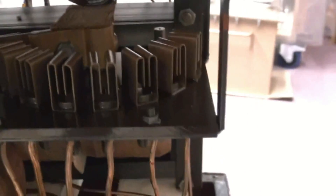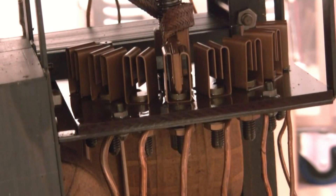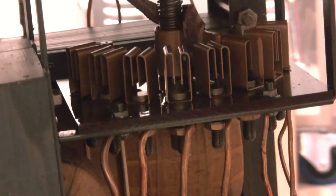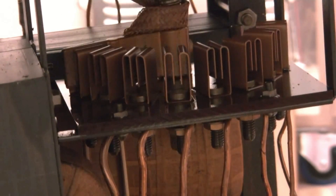This little bit here is our choke — it just controls the amount of amps. Coming around the other side, we've got all those different taps off this choke. The further along the winding it is, the finer the gauge and the less current. When it's right around on that position there, it doesn't even go through this ballast — it goes straight off the transformer.